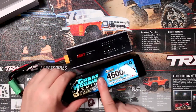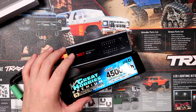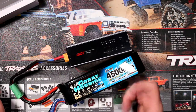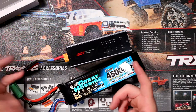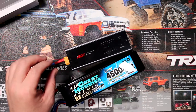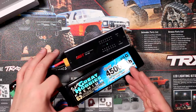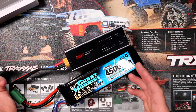Last time I discharged this 4500 battery at 6 amps, I think it took roughly maybe an hour. If I put it on my charger it would probably take four to five hours to discharge. It's not something that will discharge your battery instantly — it will take at least an hour, depending on capacity. If you put a smaller battery like a 2200, it might take half an hour or even less at 6 amps.